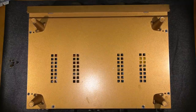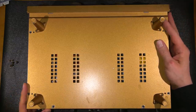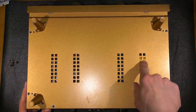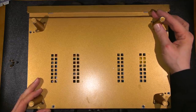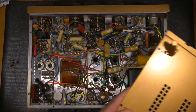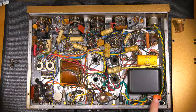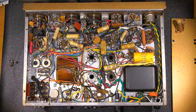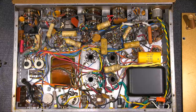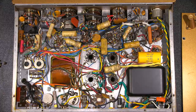Let's take a look at the underside and see if this thing still has the waxies in it. I removed all the screws on the bottom side, and you just slide this back and this comes out. I can already see an old capacitor with a paper shell on it right here, so this isn't looking good. Let's see what's under here. It's looking pretty much original. Yes, lots of paper and foil capacitors everywhere. So those will definitely have to go.